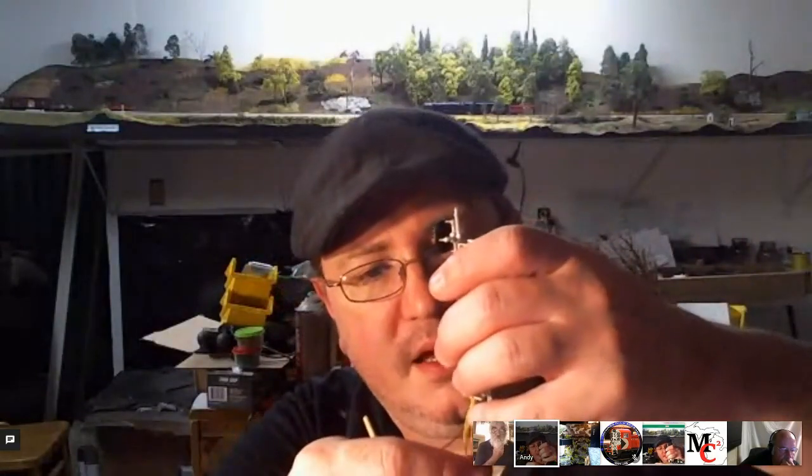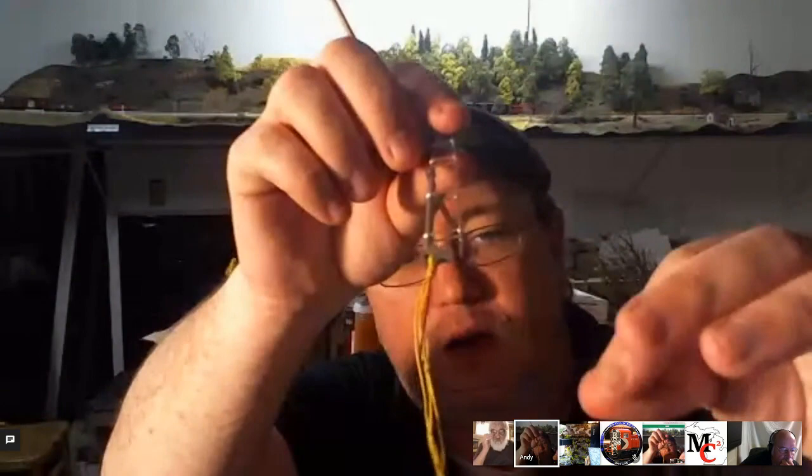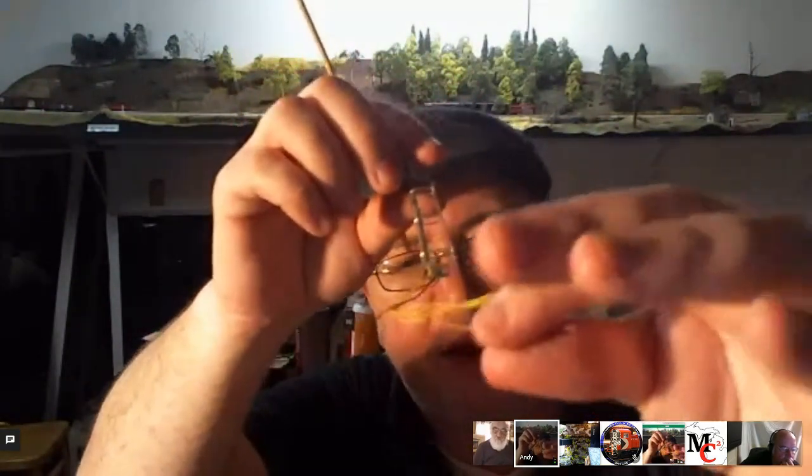How would you wire the middle light? Now, there's 2 ways to do that. The way these guys do this, and this is the way I would do it too, is that they run the 5 wires, the common ground, and the 4, which is your 2 in pair and your single center, and then trigger it off from an Arduino or a signal control board to control when the center fires. I like that.